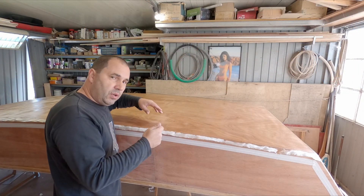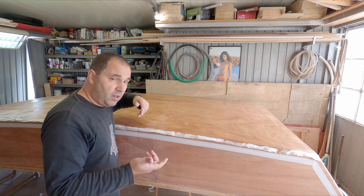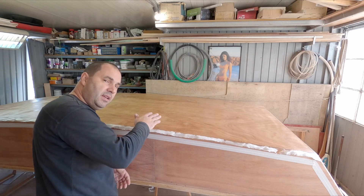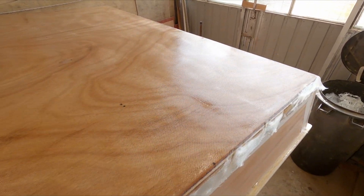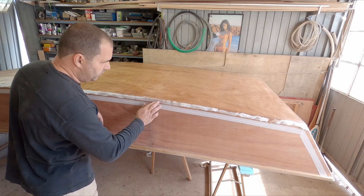As you can see I've spread all the epoxy and then removed the excess with the squeegee. It's not a very good squeegee - that thing is not that straight, it's a bit of plywood - but you shouldn't have many really shiny areas on the cloth; you should still be able to see the weave. And now I'm going to grab a brush and do these sides.